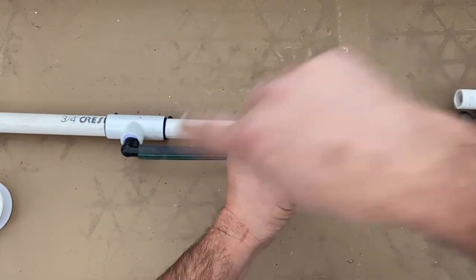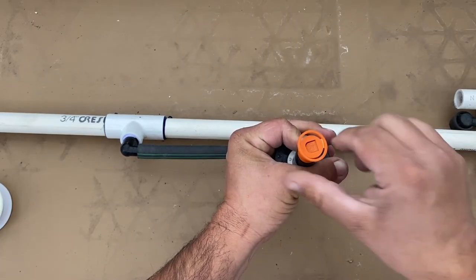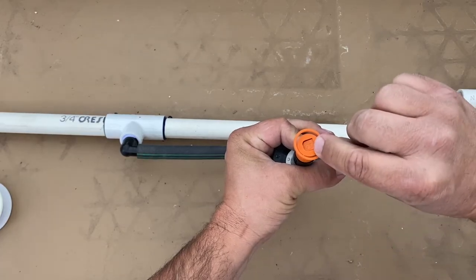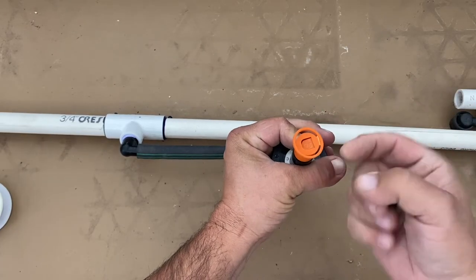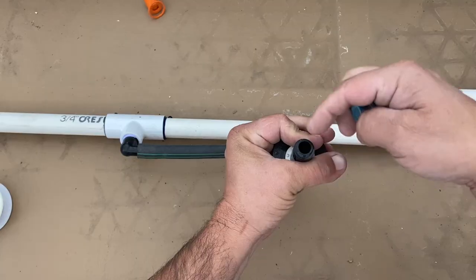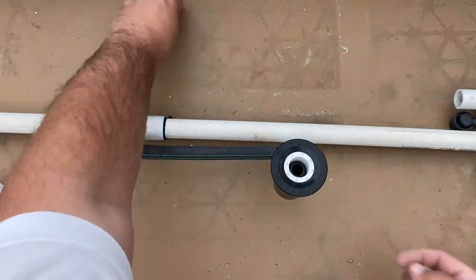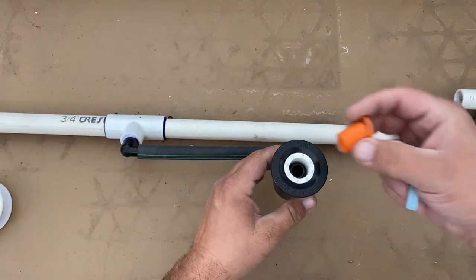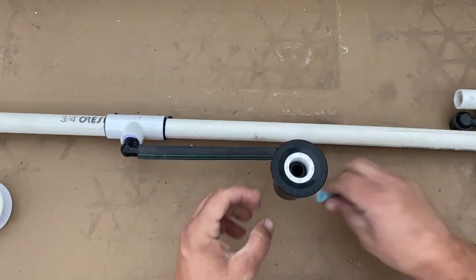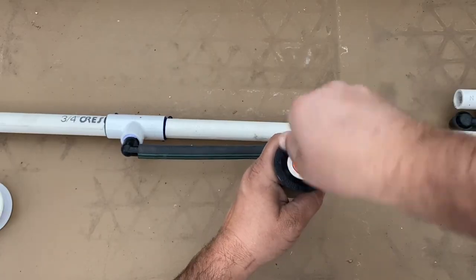The last thing — it will pop up unless you have dirt in the line. If you do, it's made so you can flush it. That little flap allows water and debris to escape without the threads dropping back down inside. If you drop it down in there, you won't be able to pick it back out — you'd have to disassemble it or use the provided tool to twist it down and pick it back up.